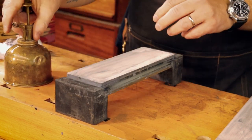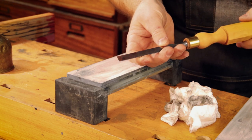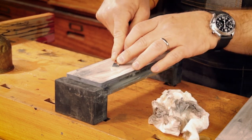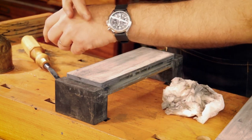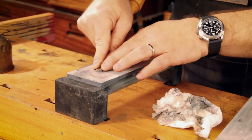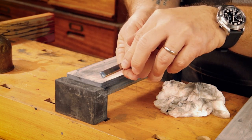Now these stones don't need to be wet all the time like traditional waterstones. You can actually see where in the manufacturing process it's not as flat as the stone already is. I'm going to stick exactly with my former technique — what I was taught was to seat the bevel without the use of a honing guide. I'm seating the bevel, and you can see where the bevel was put on with something that had a curve in it, so I'm flattening it and getting rid of that curve.